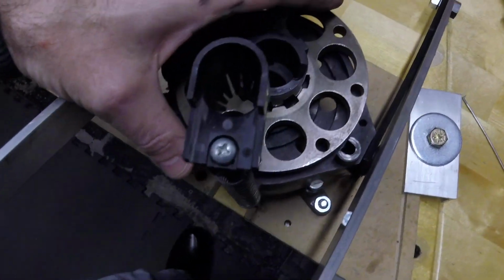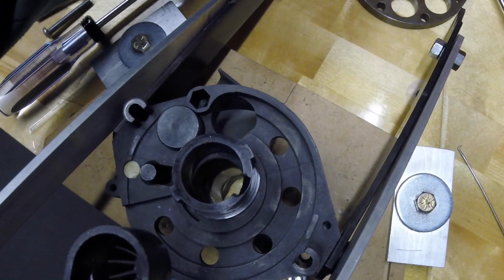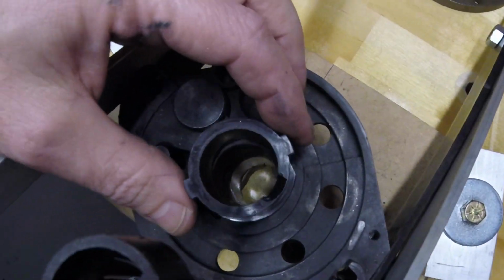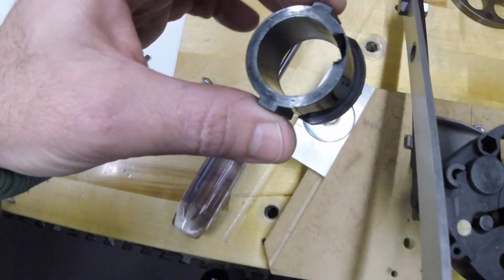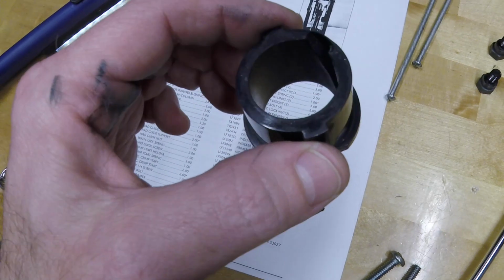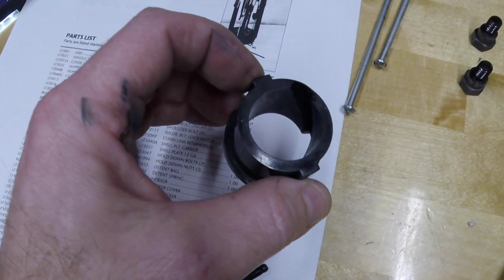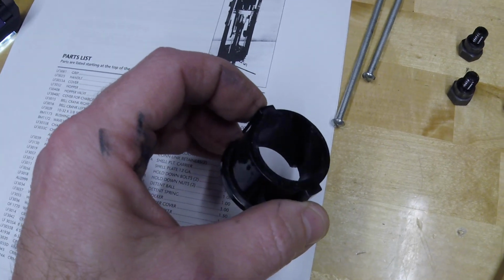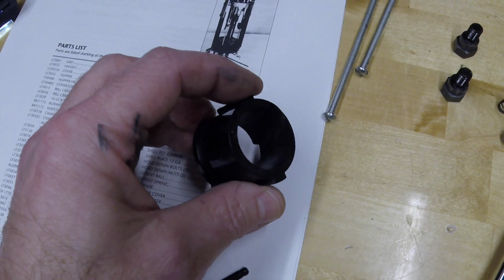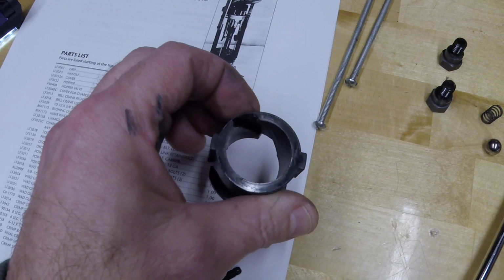And now, if we look down here, I can take the shell plate off. The indexer cover already fell off, so it's back here. And then here's the indexer. And this is probably the part that Ray has the problem with, I would guess. Let's try to get some light inside of it, and you can see, hopefully, that slot in there. It's like a slanted keyway that makes this rotate 1/8 of a turn. You can see it against the white paper there, the groove in it.